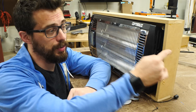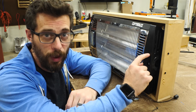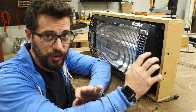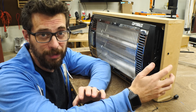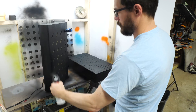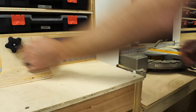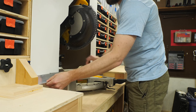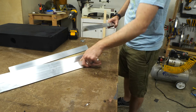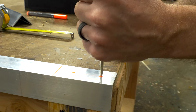I want to point out that I drove those screws into very specific places — I made sure that I put those into spaces where I knew there was no wiring and no electrical stuff behind there. You definitely don't want to drill or screw into an area where there's wiring because you might strip one of the wires and cause a short, cause a fire — that could be really bad. I pulled the heater back out and then painted both of these boxes black with a couple of coats of spray paint. While those were drying I started working on the brackets to hold the two boxes together. The brackets are just four pieces of angled aluminum from the local home center. You can cut thin aluminum with most woodworking tools so I cut these down to length with a miter saw.